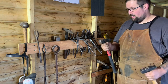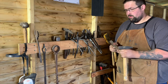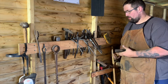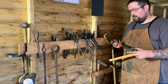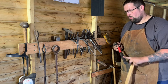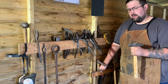I've got bigger, heavier three or four pound hammers as well as smaller ones, and hammers with chisels on the ends. Car boot sales are fantastic for getting hammers. I would recommend getting wood handles if you can — synthetic rubber handles will cause more blistering on your hands. Two pounds is probably a good starting weight, though you need to find what works for you. If I'm doing a particularly tough piece, I might go up to a three or four pound hammer.